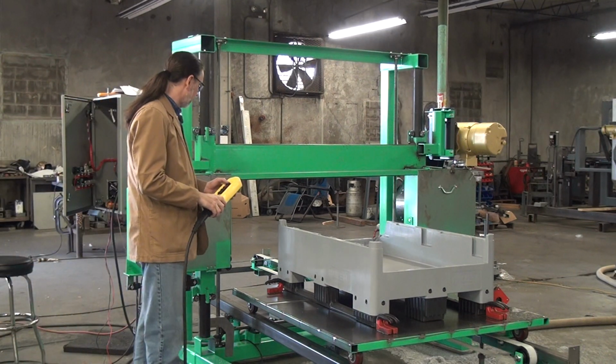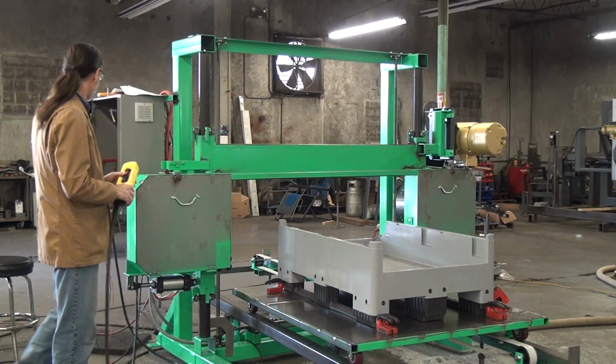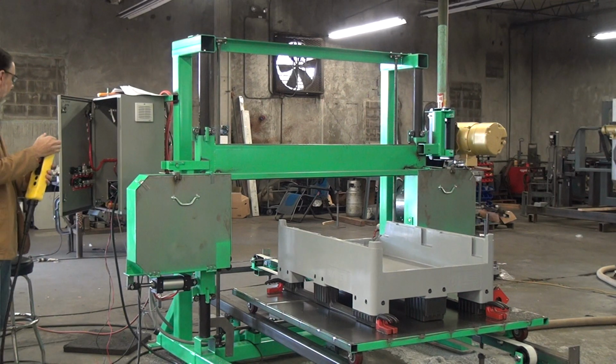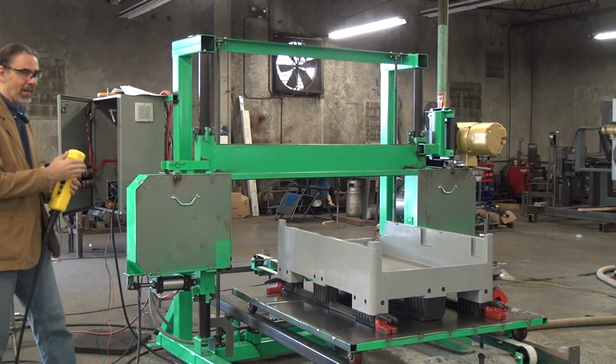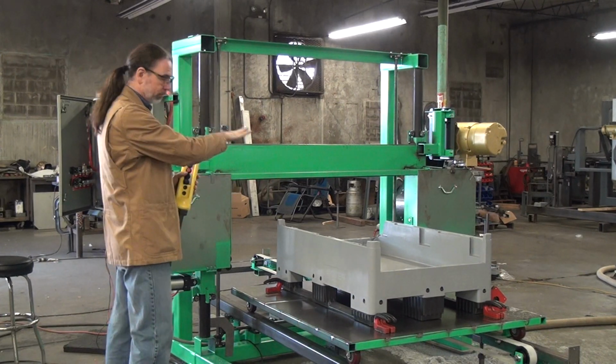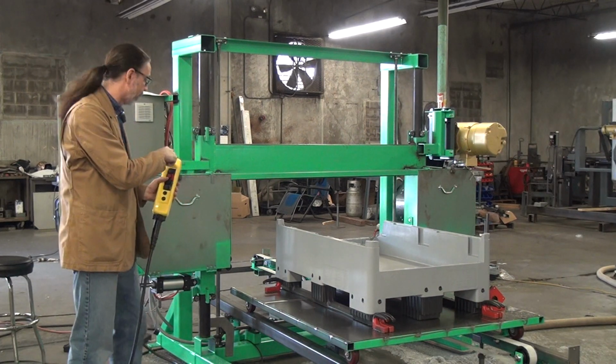So, start the blade drive motor. Dust collection. Then I'll start the table drive and slowly ramp up that speed. So the table is mounted slightly off perpendicular, such that when you put a rectangular workpiece on the table, we start by cutting a corner first.